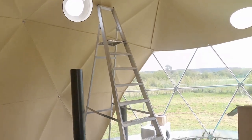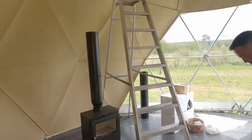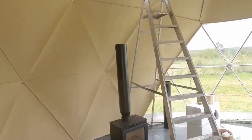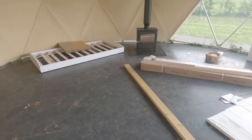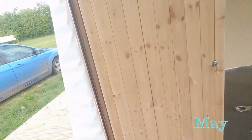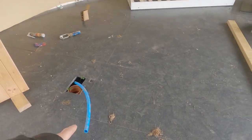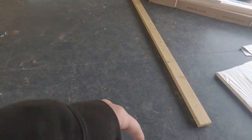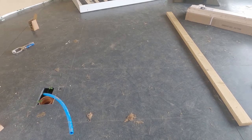We've just got Chris here, who's from Glamping Fires, who installs all our wood burners — he's the HETAS-registered installer. So we've got the new wood burner going in, the insulation's starting to go in, and it's all coming together. Today we're going to build the bathroom box. We've got all the stud work timber up, and I've scored out where the supports are underneath the floor so we can build the box to shape. We've got the services already — we just need to make sure we get everything in the right place.